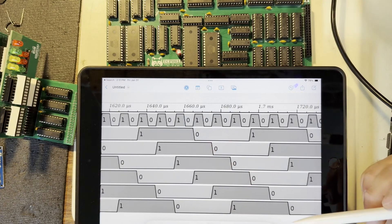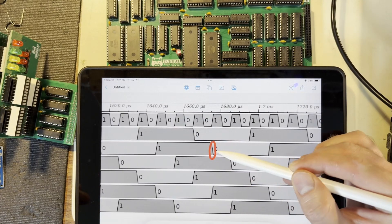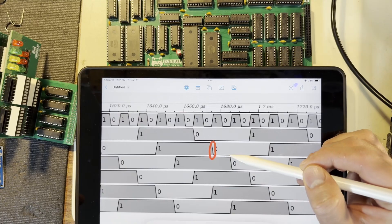If you have something that needs to activate on a particular phase, you have the option of choosing either an active high or active low signal just by switching between these two phases. This also takes care of a lot of the timing and race condition problems because you can just have things spaced out between different phases. So for example, if I want to write something to RAM, I could assert the address to the address lines here and then on this phase, write the value.